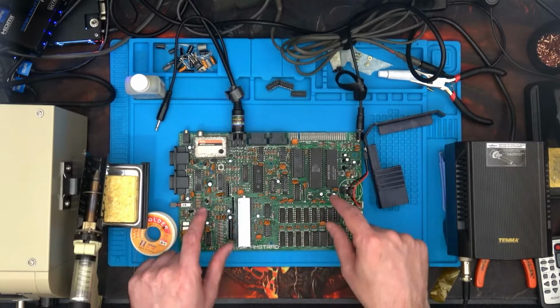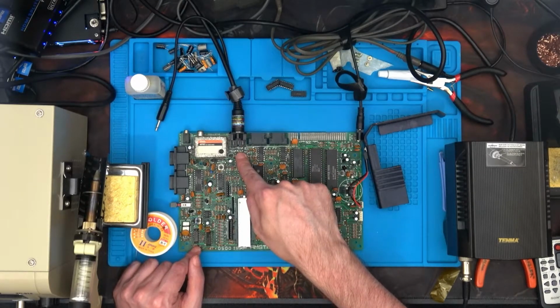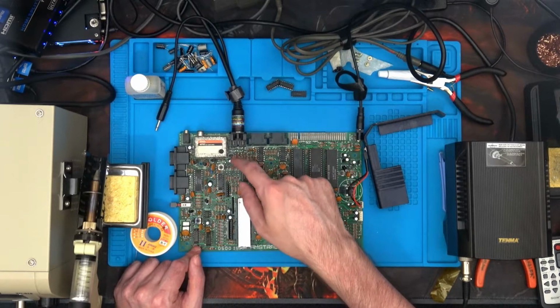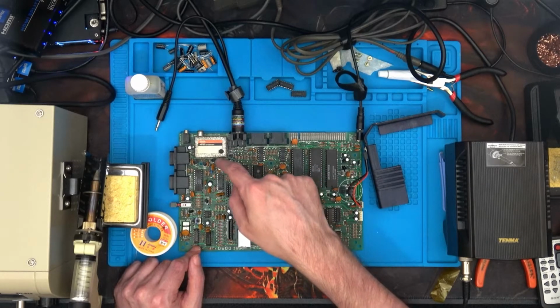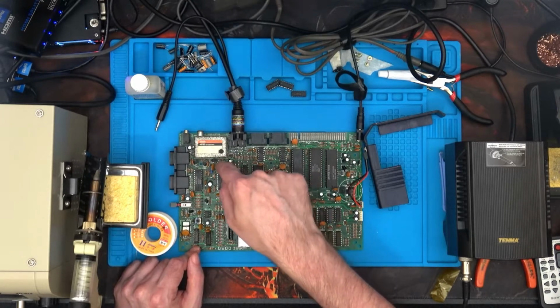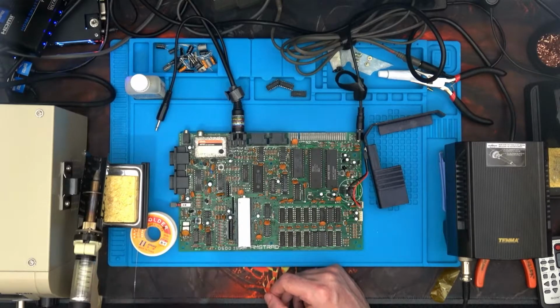But anyway, they've all been swapped around, and now, because of Retro Computer Shack, they recommend in their manual for the cable that if you know how to solder, you play around a bit more and switch LK4 for LK2, and then R9, which is actually empty there, that line there, put in there a 470 ohm resistor. So I'm going to mess around and do that now.